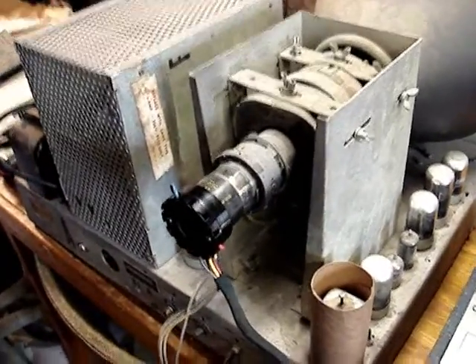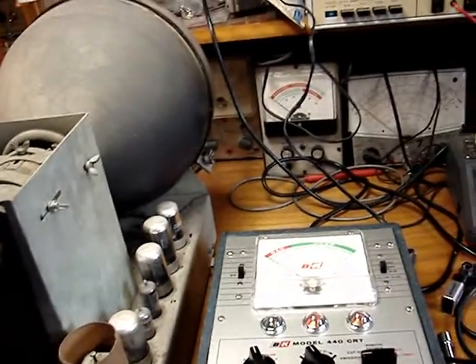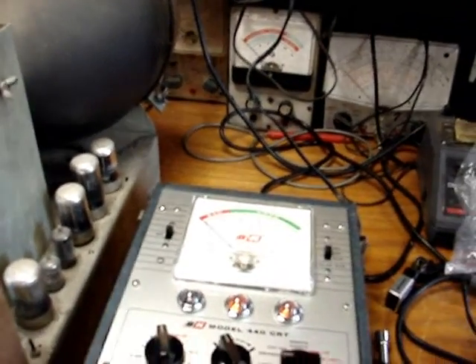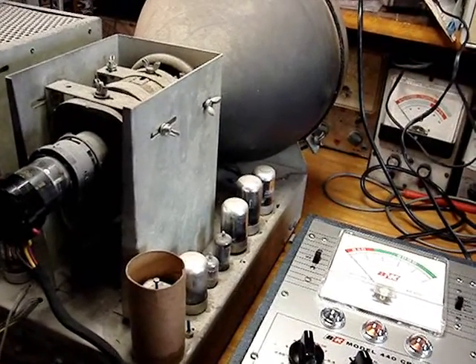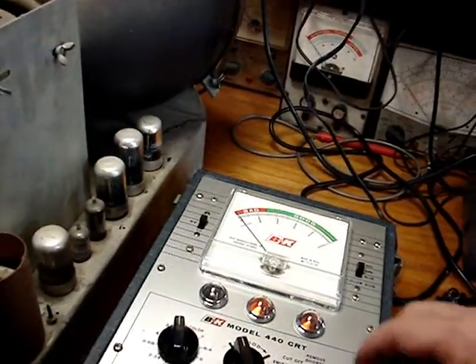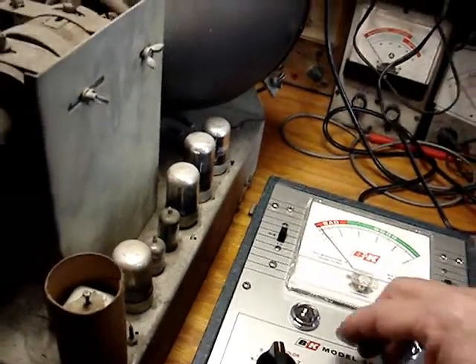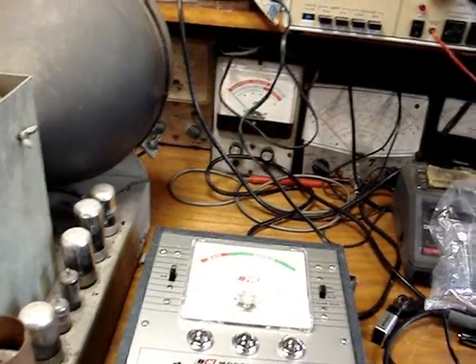I got the tube filament lit. I couldn't get it to light when I was at the other location — when it was where I picked it up from, it was dead and I couldn't get anything on the tester. But maybe I'm making good contact with the pins now. At any event, I do have action out of the CRT. If I go to cutoff, I'm at the low end but within the range of what they say is good.